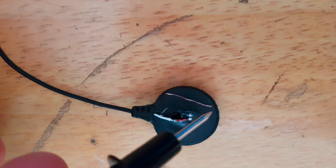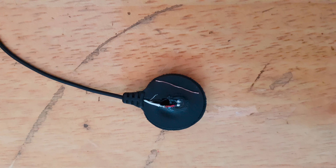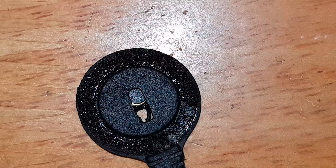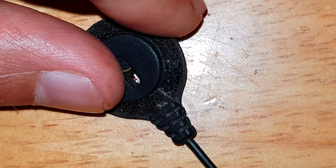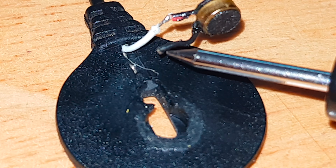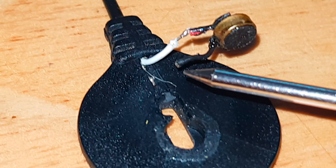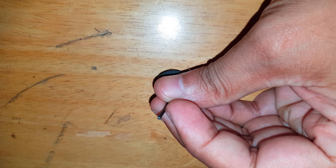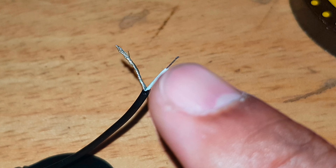I've taken a small strand of wire to create connectivity between the negative wire and the soldering point. But first we need to remove the sponge — be careful not to tear it. You can see the tiny piece inside with the gold element; that's the actual mic, and the plastic is just a placeholder to hold it. Pulling the mic out, you can see the black wire below the white one — that's the negative, and it's disconnected. I've now spliced the wire so the negative and positive are prepped and ready to be soldered onto the mic.